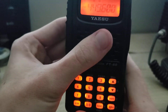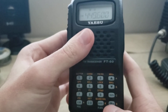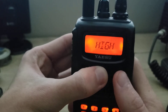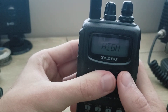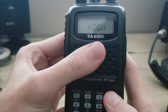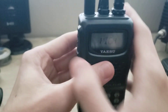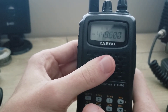For example, to change power settings, press the function button, then TX PO (transmit power). From there you can select low, medium, or high power — which correspond to a half watt, two watts, and five watts respectively. Use the up/down arrows or the knob to select the level you want. Press PTT to exit and save.